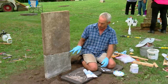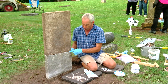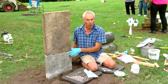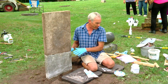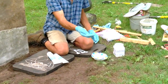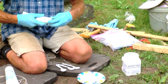We're going to focus on filling in this loss. This edge was very rounded. The front is a tighter joint, but we're focusing on the back side where the edges are very rounded out and there are actually holes. We're going to show one way to make an infill material made largely from marble sand — a fine white crushed marble — combined with the same clear UV stable epoxy, adding a lot of marble to it.